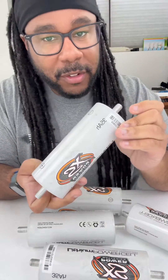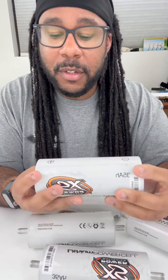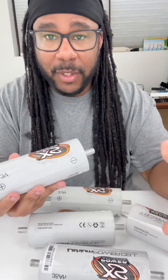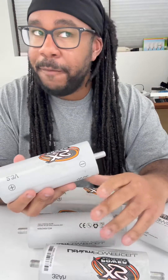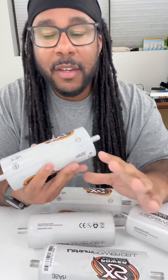By size they're the same physical size, just more capacity internally. They are 2.3 volt cells, which means it takes six of them to create a bank. The resting voltage of a bank is around 13.5 to 13.8 volts, and you want to charge them in a bank around 15.4 to 16 volts. It's a little more tricky to use.